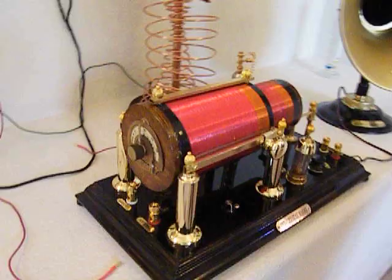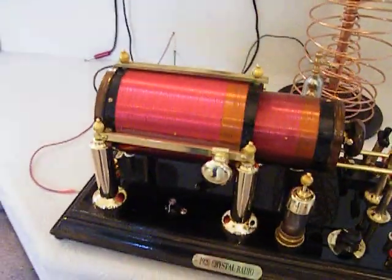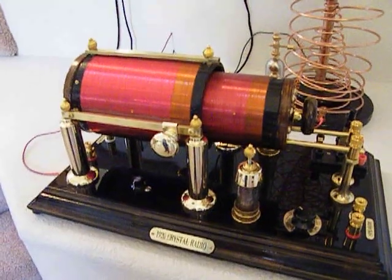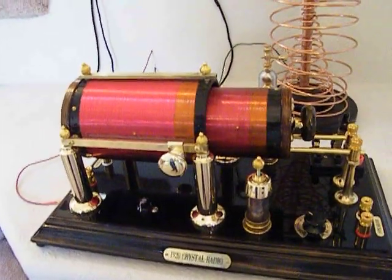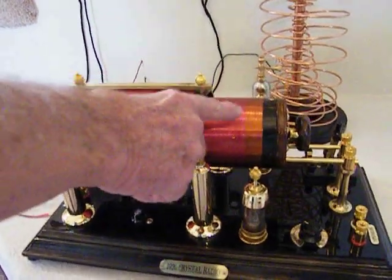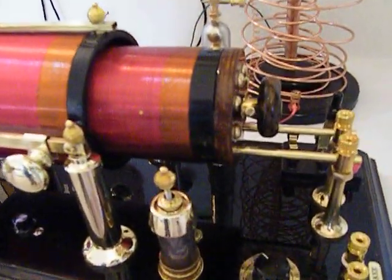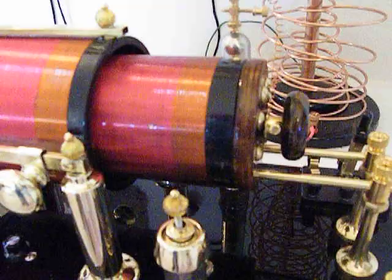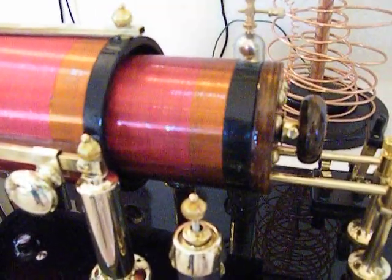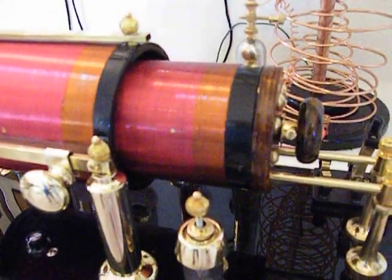First of all, this is a piece of 4-inch PVC — that's the primary coil. It's 4-inch ABS, and we have 24-gauge insulated copper wire, 200 turns, counterclockwise. The smaller coil you see here is a 3-inch ABS pipe, 22-gauge insulated copper wire, with 170 turns, counterclockwise.